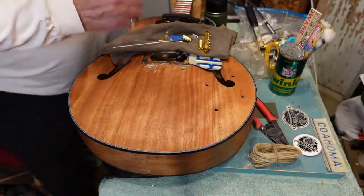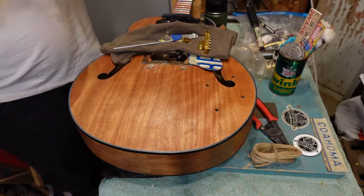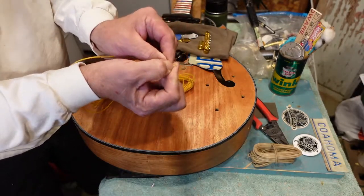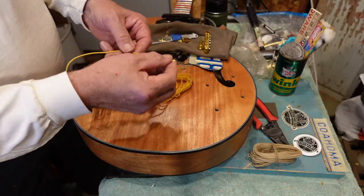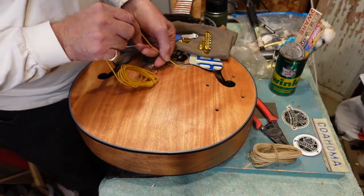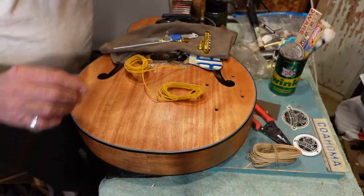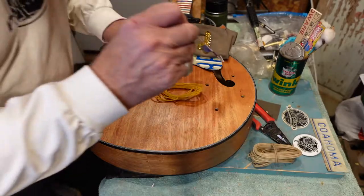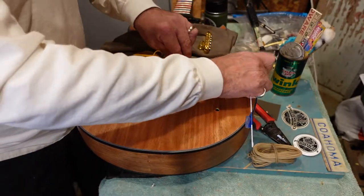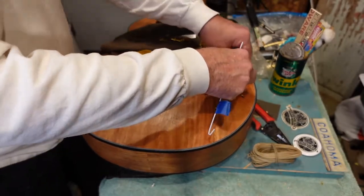The kit has given you options. Now that we're ready to put this in, remember that hole is there. I'm going to take a piece of yellow pushback wire — this wasn't in the kit, but you've got everything you need to build the kit. They call this pushback wire because you can push the insulation back, and it's pre-tinned, meaning it's ready to solder. I'm going to take this piece of yellow wire, push it through, and since I know I'm going to ground everything to the potentiometers, I'm going to cut it a little bit longer than that. Then I'll take a piece of coat hanger, reach down in there and pull up that ground wire, loop it through and tie it back so it won't come undone.